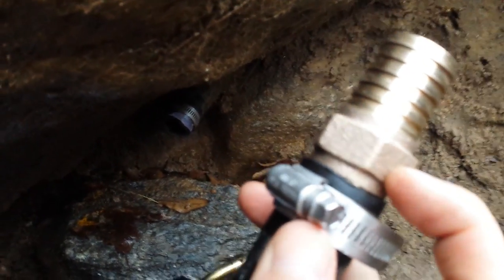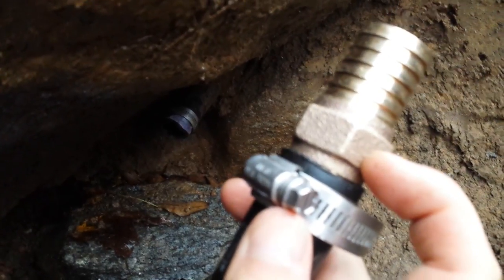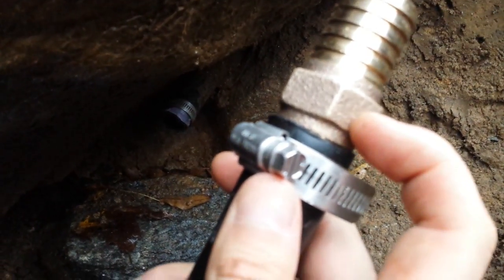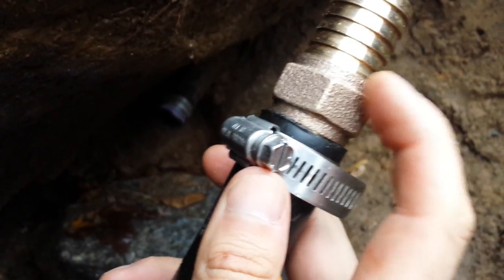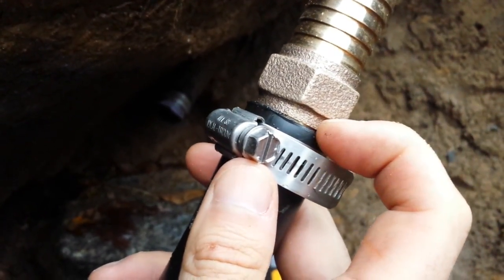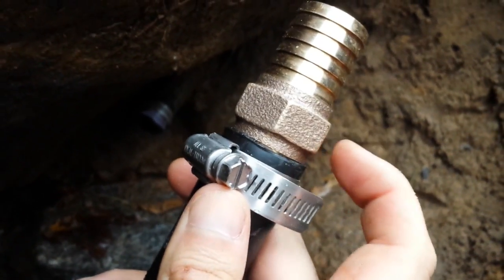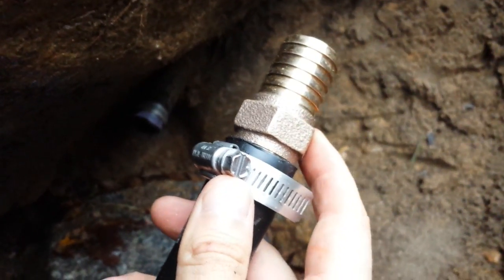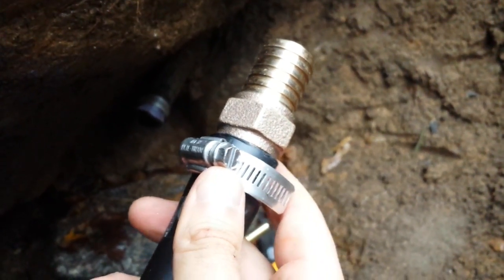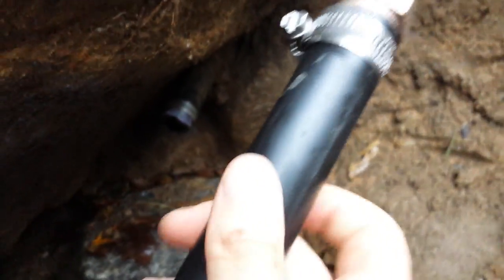If you have plastic pipe, the end brass fittings have to be brass couplers and they have to be barbed. You need the nut part showing — when you install it, the water company or a plumber will look at it and say it's done correctly. If you have something that goes inside a piece of plastic without the barb, don't do it. These are only six dollars — grab two of them. If you have a small leak, do one coupler, split it down the middle, and put this in there.